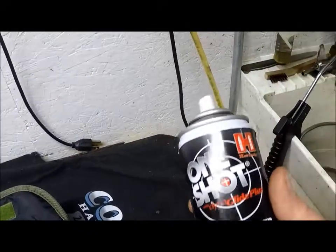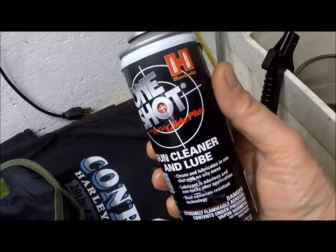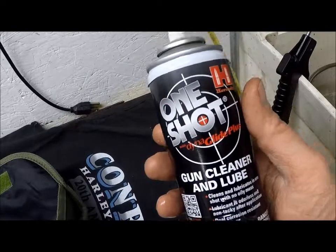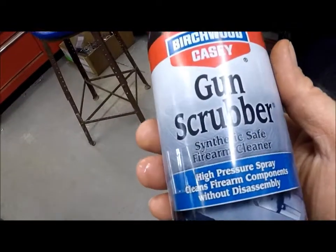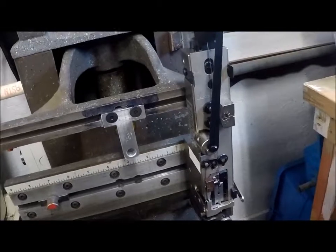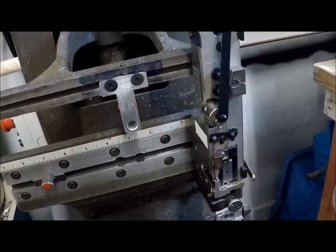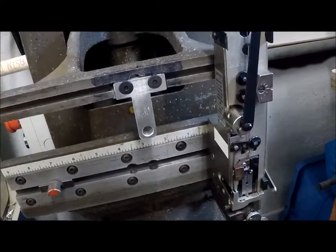A good thing to have around — you can go to Walmart sporting goods section or a sporting goods store — this gun cleaning lube is good stuff, or anything like it. You can spray that on your heads, blow off all the old dirt and crap, and it'll actually clean and lubricate. Another good thing — this gun scrubber is sort of like brake cleaner but it's made for guns, and guns have a lot of sliding and moving parts just like a stitcher head. I don't use this stuff a lot because I completely disassemble the heads, strip them down to little piece parts, and clean all the parts individually in an ultrasonic tank or solvent tank. But in a pinch, if you don't want to take your heads apart because you're working on your machines in the field, maybe you just spray out the bad stuff, let it dry, and then go back to running it and lubricate it.